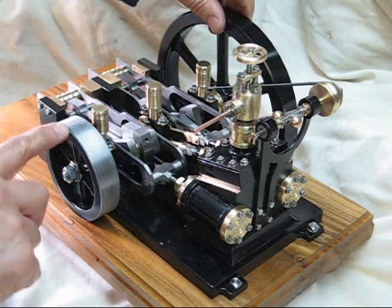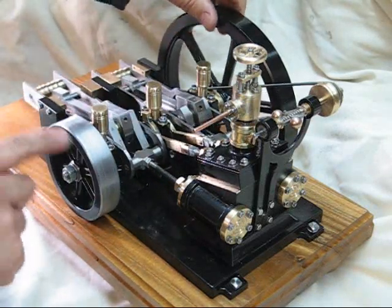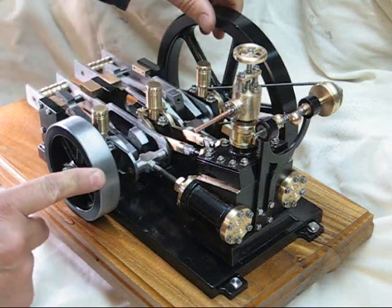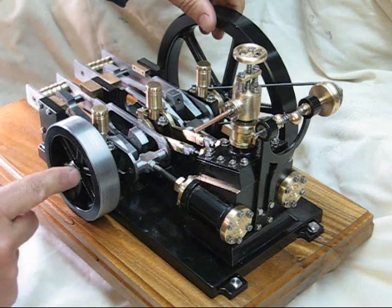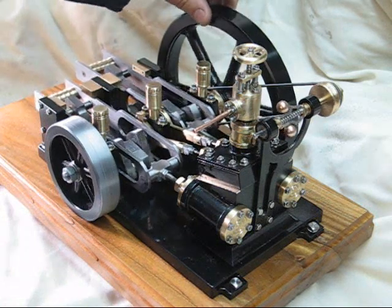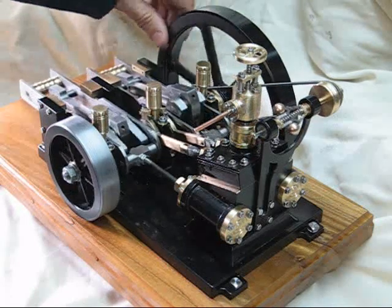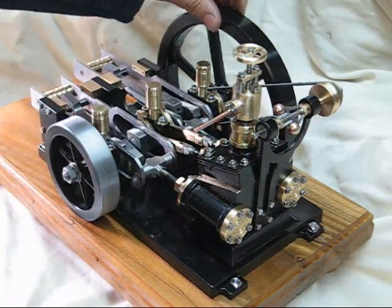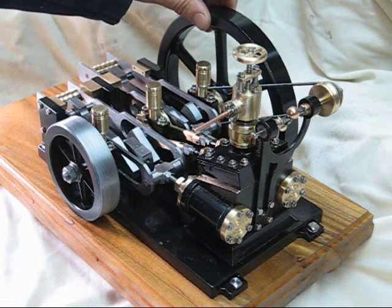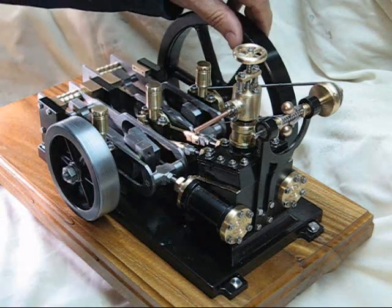The pulley flywheel — I've fabricated that up from a piece of tube, a piece of stock in the middle, and spokes. They're all Loctited together. I was quite surprised just how well it held together. One of the keys with Loctite is having enough surface area on the bond — if you only have a small surface area, you're not going to have a very strong bond.